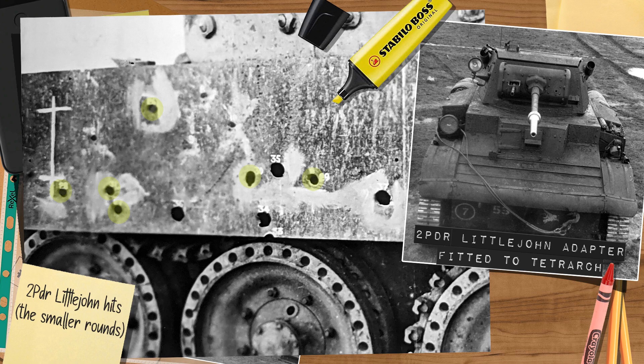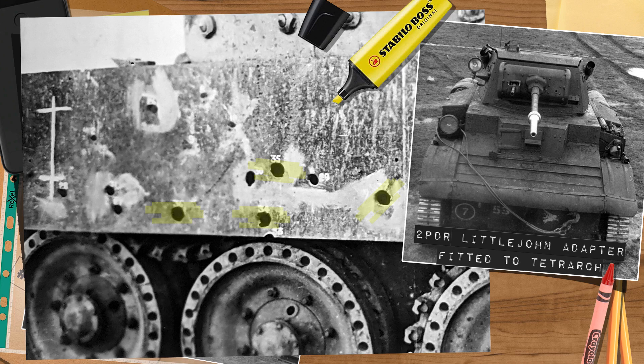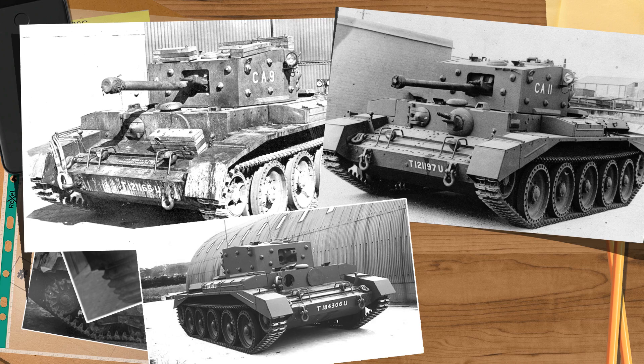Against the hull side the story was similar to the PIAT results — the upper hull side was perforated, however the lower hull side, while bulged and cracked, was not, though there was some severe spalling. Next were the 50mm rounds. Like the two-pounder rounds these behaved erratically — some failed to detonate though they did perforate the tank, others struck the tracks or suspension. However, most were able to pass through the six-millimeter skirting and detonate inside the tank, with heavy spalling also noted.